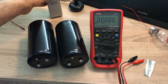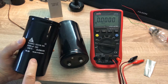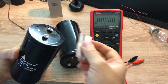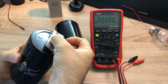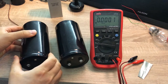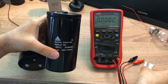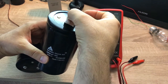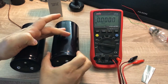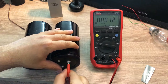I will charge one of these capacitors at 200 volts for one hour, then discharge it and keep the terminals shorted for 10 seconds, then remove the short and measure the recovery voltage. For the other capacitor, I will charge it for only 10 seconds, then discharge it, short the terminals for 10 seconds, then remove the short and measure the recovery voltage.